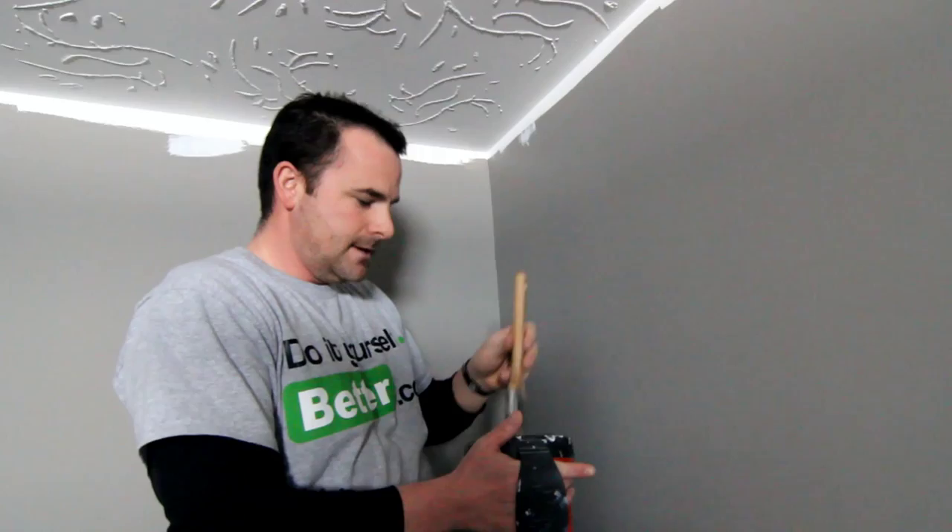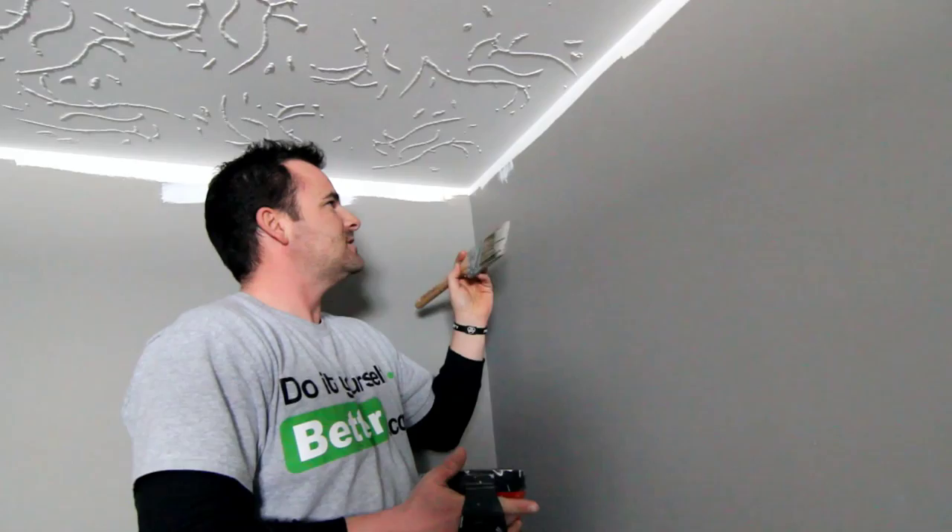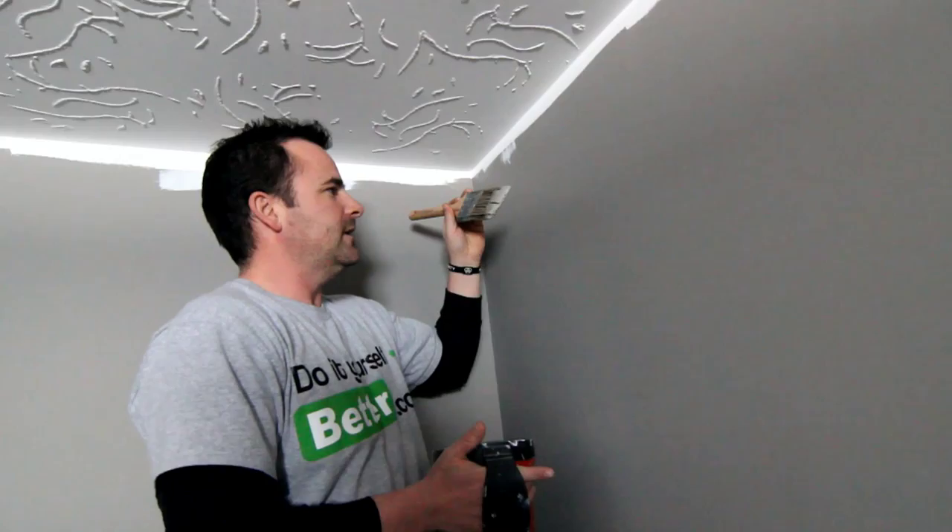Let's cut into the inside corner. I'm using a two and a half inch brush. I don't really use much smaller — I'll use a two inch if I'm doing windows and stuff. I've only dipped just the tips of my brush and I don't need to flick it too much. I don't need a lot of paint.